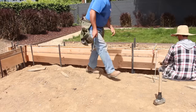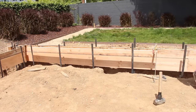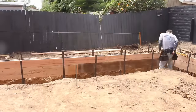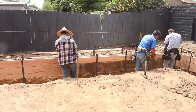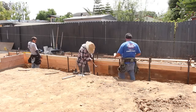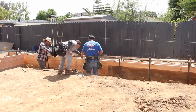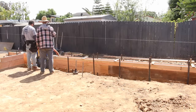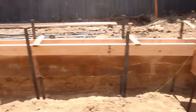This is my inside form — you can see I've already ripped it so it's tapered. This is where the board ends at the high point at two inches, and the other end I left at full height since it was a two-by-six that I ripped — two on one side, two and a half in the middle, and three and five-eighths at the other end, giving me the three-inch slope. This is also a good guide that I can rod the slab to — the bottom of this board gives me slab height, and the top gives me top of stem wall, which is still level.